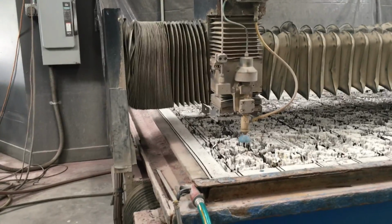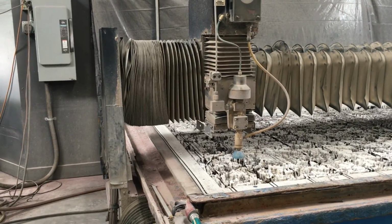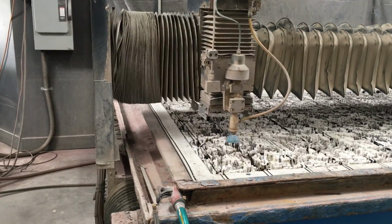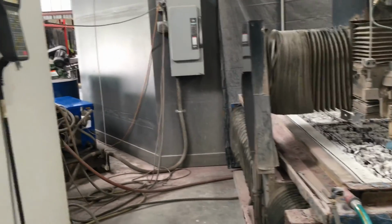Nozzle, which I'll be honest, I run mine until the cut just looks too wide. Then I'll change it. Most people will say you get 150 hours or so on a nozzle. I get probably 400 hours on a nozzle, unless we break it. And if we break it after the 150-hour mark, then I don't really care. We got our money for it.